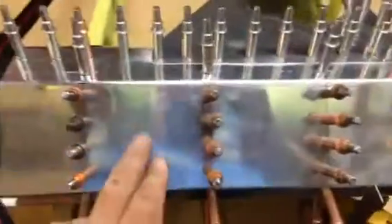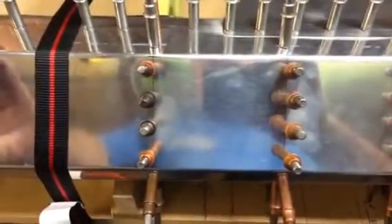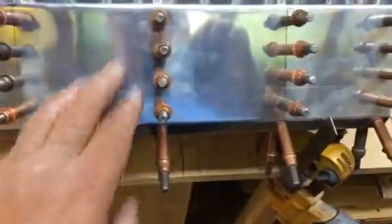I've got to cut out the holes here — cut the leading edge section out for each one of the hinges. There's one here, one here, and one down there. After thinking about it, I've decided to prime everything and assemble the entire flap 100% — every rivet, everything — and then come in and cut this out, work it with a file, and get it flush up to the nose ribs. That'll make a perfect little pocket. I'll probably go back and reprime that one area, but other than that, not much to it — just a lot of time.